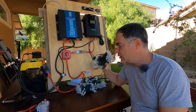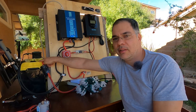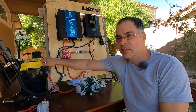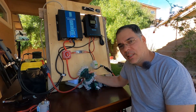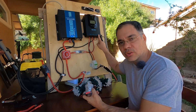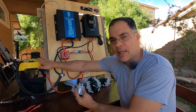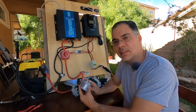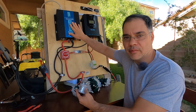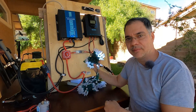Over the winter I'm going to be running my holiday lighting with this outdoor solar system. I'm using a heated LiFePO4 battery that I DIY'd — see the video in the link to see how I built it. This battery will be able to handle the winter temps, but I do not want to run the lights during the day and I do not want to over-discharge my battery during the night. We will use the load port on the charge controller to drive the actuator side on the contactor, and use the switch side of the contactor to control power from the battery to our inverter. The contactor acts just like a DC disconnect switch turning power to the inverter on and off.